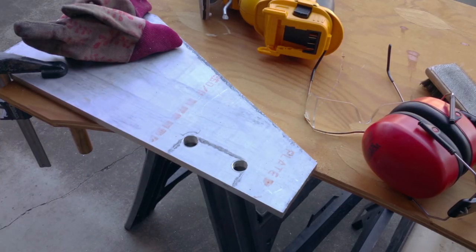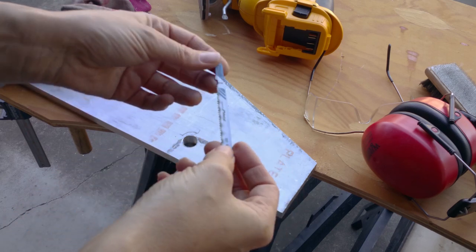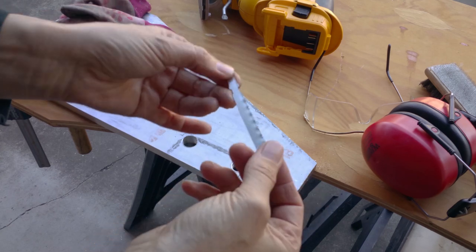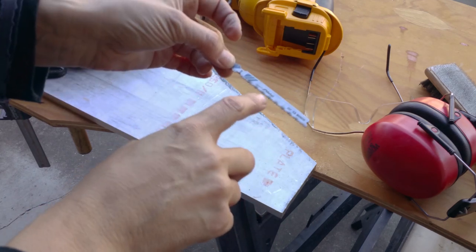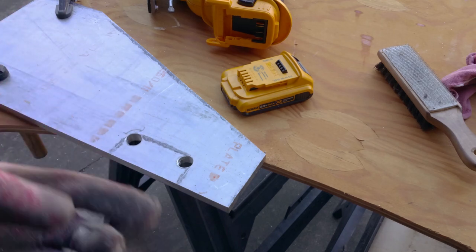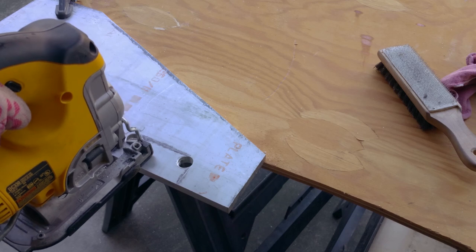I still don't like using battery operated tools beyond their capacity. I know this saw is designed to do this, but I don't expect the batteries to last forever and I can't afford to buy another saw of this quality. I have this clamp just to a block. This is a rat tail file - it's very coarse and it cuts through material very quickly. If I just filed like this I could never keep a line, but if I follow an angle like this and then reverse it, it'll give me the benefit of removing a lot of metal quickly while kind of keeping it straight.